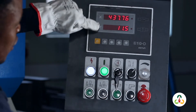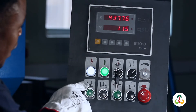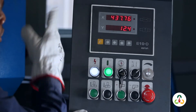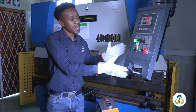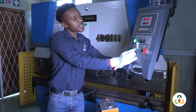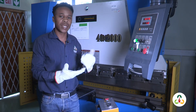As you can see here you have the X and Y, which is for x-axis and y-axis — you focus more on the y-axis. If you press the button with the arrow pointing up, you can see your numbers are moving up; we started from 11.5, now we're at 12. If you're moving up you're reducing the pressure on the machine, but if you're pressing the other button with the arrow pointing down, you're putting more pressure on the machine, which means there will be more pressure on the plate that you're bending.